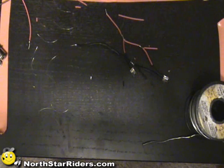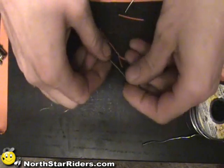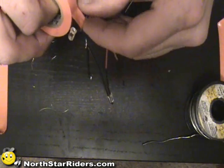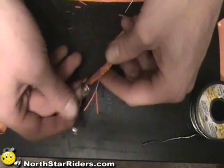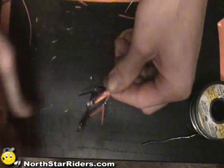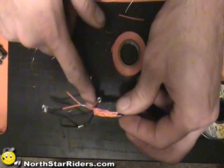One little trick that I've learned along the way is you can buy a piece of stainless steel flexible wire. You basically use it to help aim your LED. If you take a little bit of electrical tape, as these trunk lines are running through, you can actually use that piece of wire inside there and aim it. Which works out pretty handy if, by chance, you want to accent, say, the top of your motor coming down - you can keep that thing pointed down.